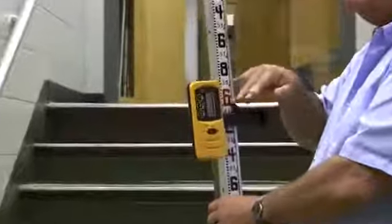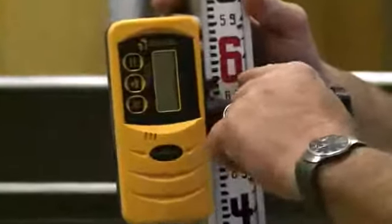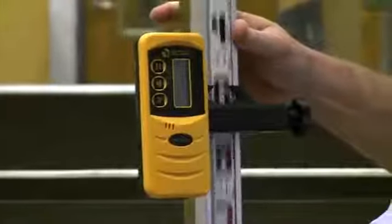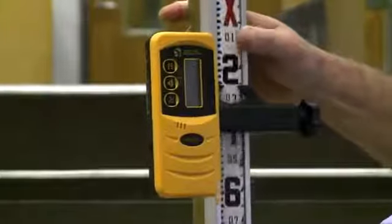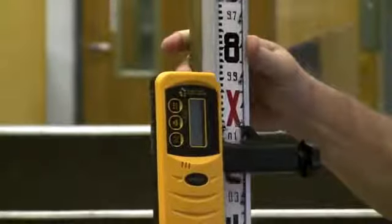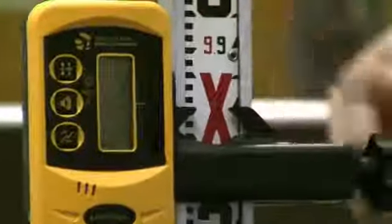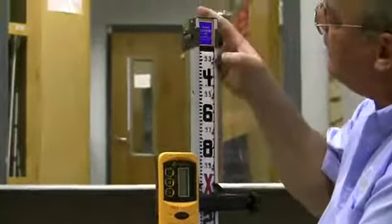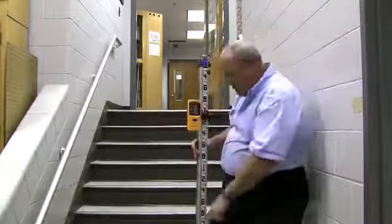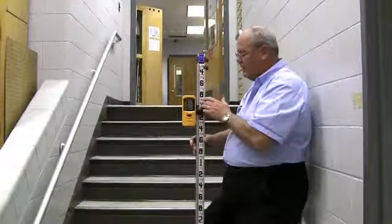This is the position on a rod that's reading that laser. And this bracket, where these two little index pointers are, is where we want to set the tape. I'm going to move the tape down to elevation 0.00, which is this X — this is either 0 or 10 feet. The top of the little slope line in the middle of the X is 0 or 10. Then I move this clasp up or down until I can get the little push pin to go into a grommet, push it in and lock it. Now we are at 0.00, and I've now transferred the elevation of this step to my laser and this rod.